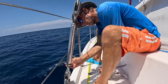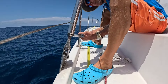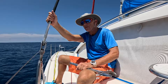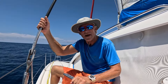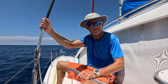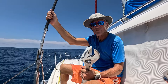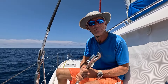We've done three full turns on the cap shrouds and one full turn on the martingale. Even though the forestay still seems quite loose, we're going to give it a rest and see how the rigging responds first before we do anything else. We're out of danger at least. Improvement in the right direction — it may not be as far as it needs to be, but it could keep our rigging right. Moral of the story: make sure you have the proper tools on board for rigging — two wrenches, not just one. And after someone does work on your boat, trust but verify.